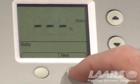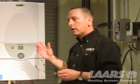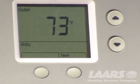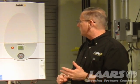Okay? Continue down, lead lag, which we're not going to talk about right here because that's done when you're cascading boilers, and that's covered in our training classes at the factory. So I'm going to start with the outlet screen. So now we've gone through, we've set in the DHW and the central heat.